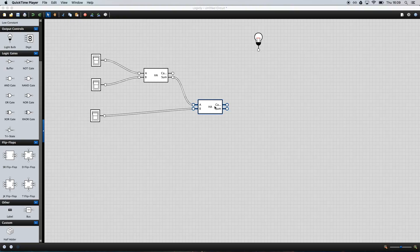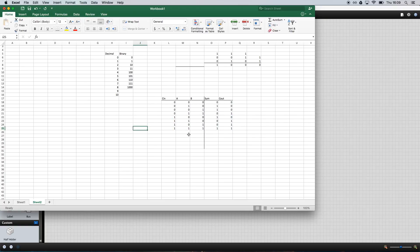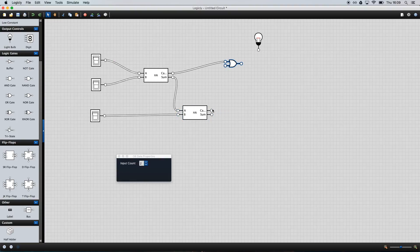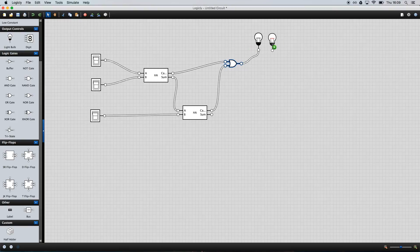What we need to do is account for that second bit in the digital logic. If either carry-out evaluates to true, then the overall carry-out is going to be true. So we take an OR gate and connect our first carry-out and our second carry-out, piping that to our output. And we're basically done — we've connected all this stuff together. This OR gate was the last big step. The sum is the sum of the final bit, so we connect that through here.